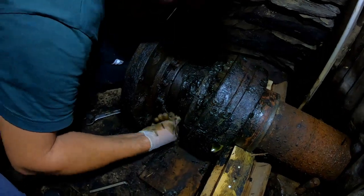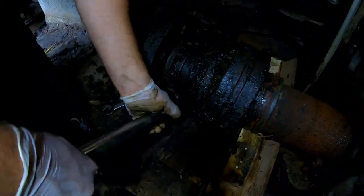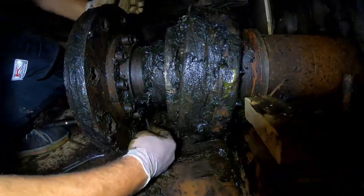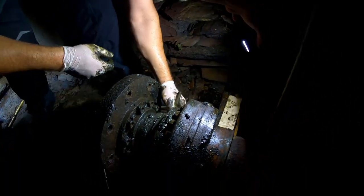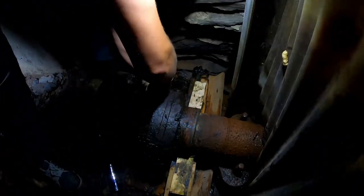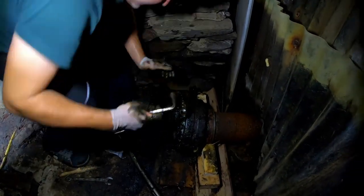The wooden housing was also under a lot of pulling and pushing stress whenever we aligned the wheel on the axle, which could happen once or twice a year. We then have to rock and move the wheel on the axle left or right and adjust for any imbalance. There is tolerance for this side-to-side movement built into the spherical roller bearing as well. The inner race, cage and roller assembly can tilt a bit in all directions in regards to the outer race. It is not possible to get everything nice, tight and square with each other in our century-old waterwheel setup.